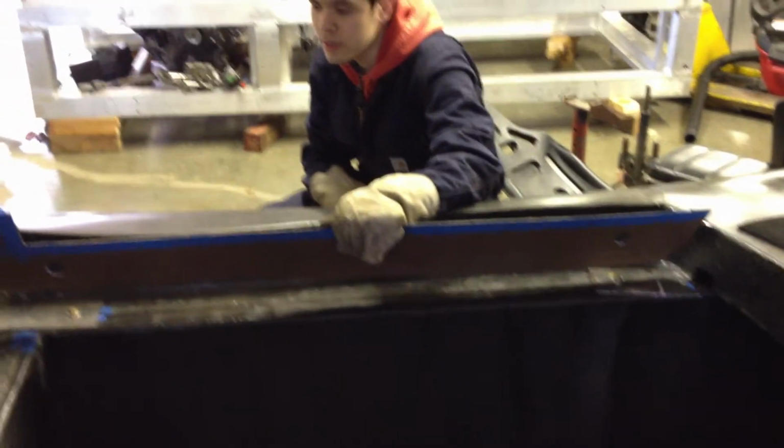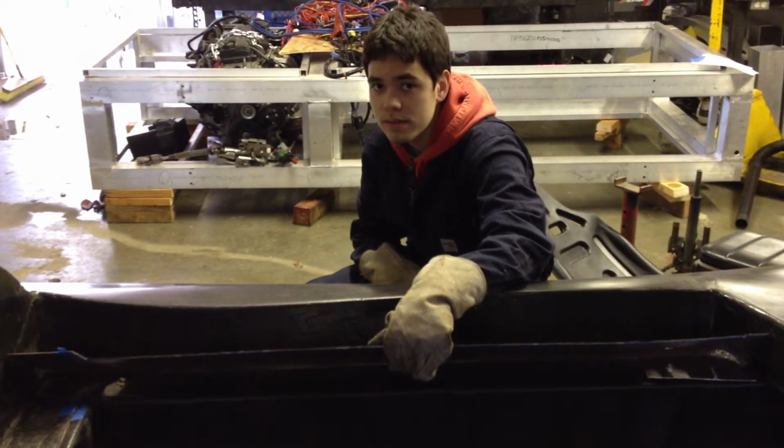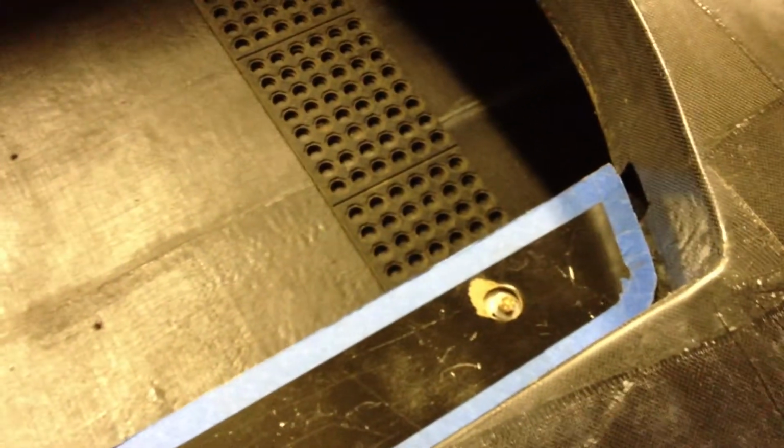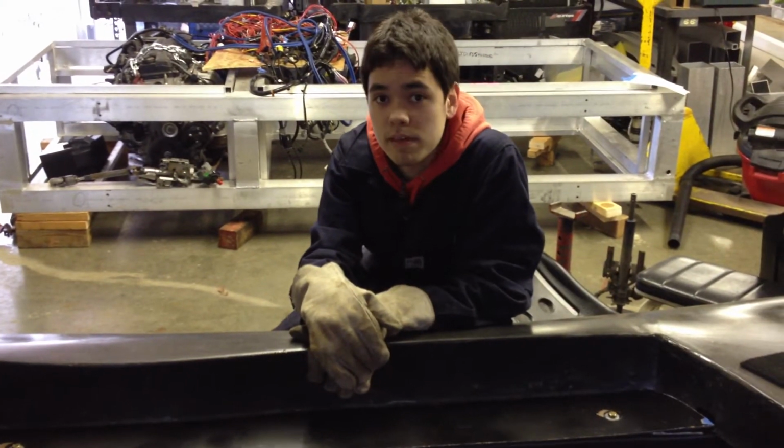Let's see. You used a jigsaw and a belt sander and a marker, and so you would freehand marker the edge, because there's a shape. It's got a curve to it, a French curve to it. Yes. And so you'd marker that shape in freehand. Use a jigsaw to take out big parts and a belt sander to fine tune it, and then set it, see how well it fit, and then mark it again, make a new line, and do many iterations. Am I close? Yeah, pretty much.